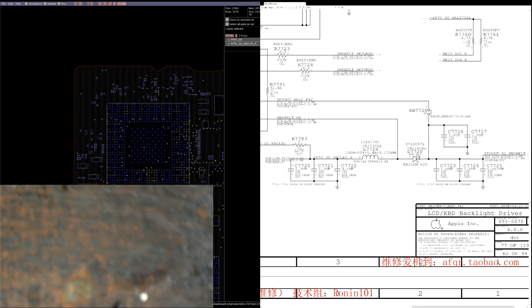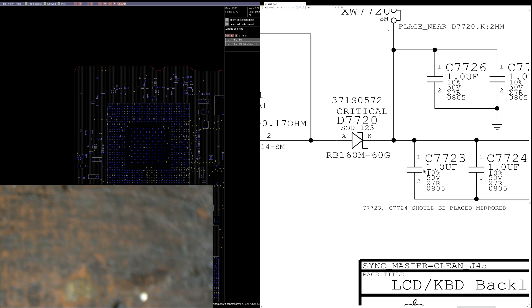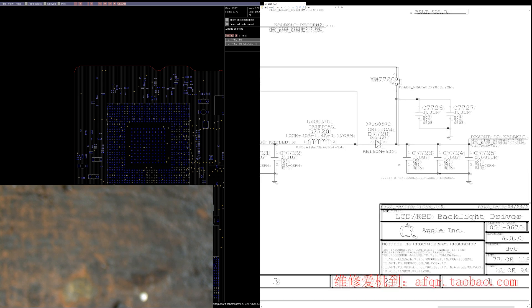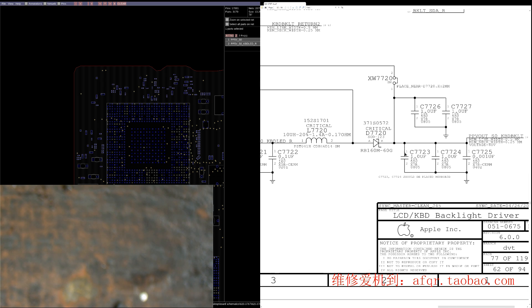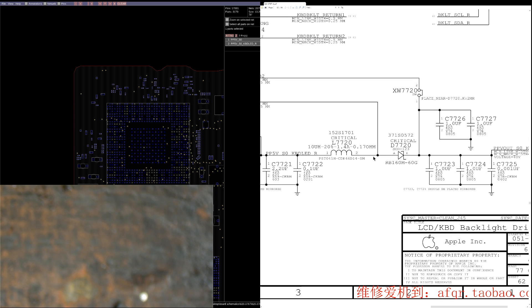The way we turn that into a higher voltage: we have a diode and then capacitors. The capacitors store those spikes of 25 volts. The DC voltage tries to make its way to ground but can't, because a capacitor cannot pass DC — it has insulator material in the middle. So voltage gets slammed onto the plate of the capacitor and stored there while it's trying to go to ground. The electrons have no idea there's no path to ground; they keep slamming into the plate. Since the diode only allows power through one way, the stored 25 volts can't go back.